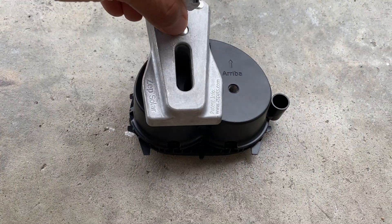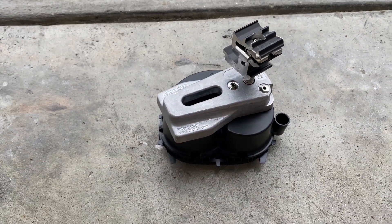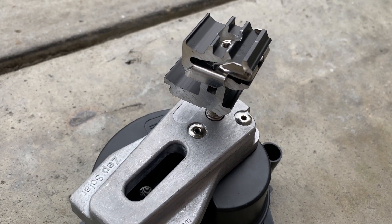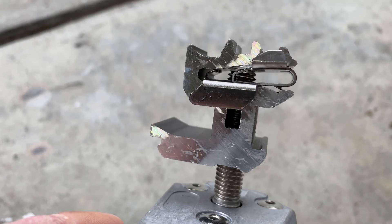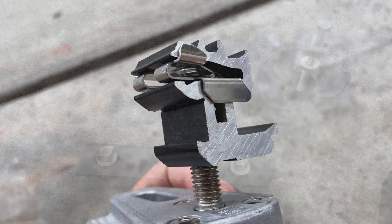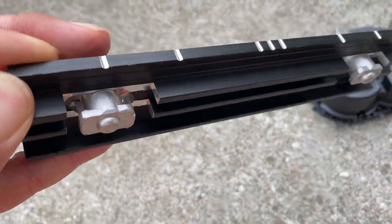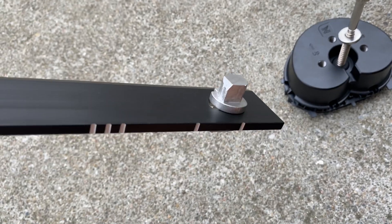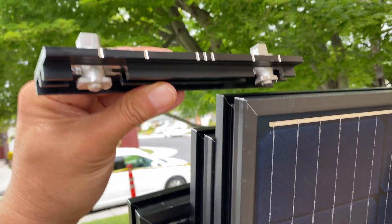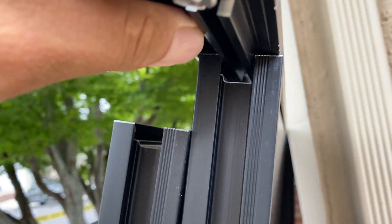Once the mount is attached to the roof, a foot gets installed that connects the panel to the mount. The three different mounting holes, slot, and foot give a lot of freedom to align it. There appears to be a stainless steel clip in the mount, either for grounding or to maintain a certain tension. This is the interconnect bar that connects panels to each other, replacing the long piece of unistrut — much easier for installers to carry up on the roof. It fits into the slot with a quarter-turn cam system that clips it into the panel.